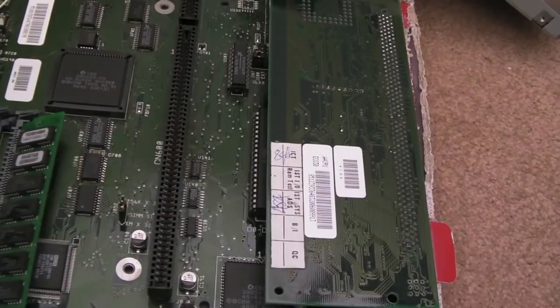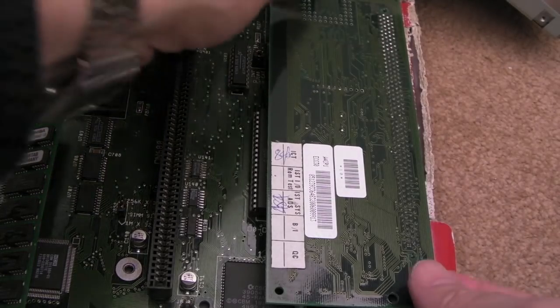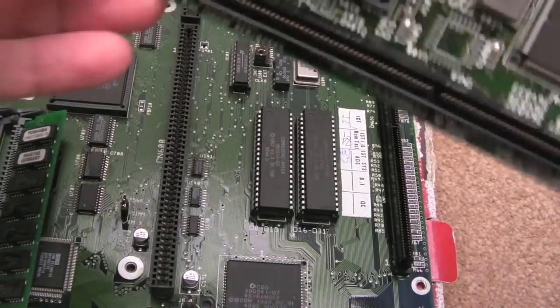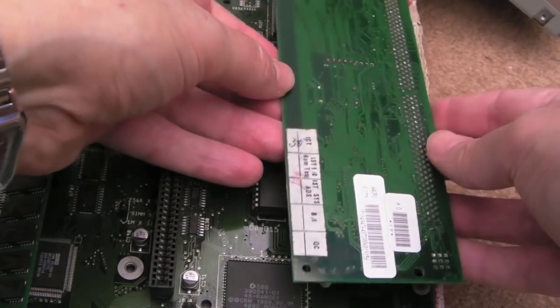No, it's not. Yeah, so that goes to show that it's this CPU card at the moment. Now bear in mind that contacts have been cleaned up on this, and I cleaned up the board again as well, because the board was equally as corroded as the slot was again. So that one is going to need a recap. Let's just fit the other one again very carefully here.